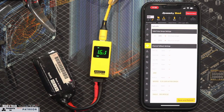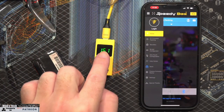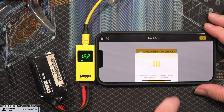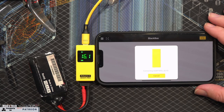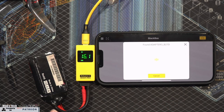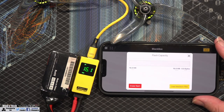We can also download black box logs. If I click disconnect and go down to black box, it goes into portrait mode. Click 'Import from flight controller' — it will ask us to connect and then switch over from Bluetooth to Wi-Fi for the file transfer part. It failed to find black box logs because on this flight controller there's no SD card. So I'm going to hop onto a flight controller that does have built-in memory.